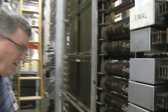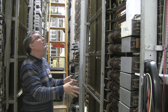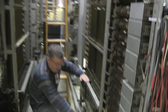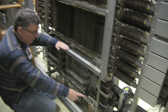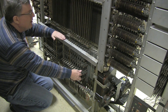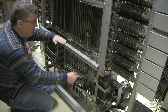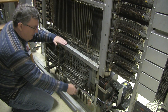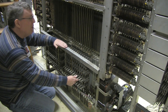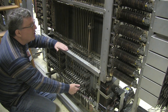The other thing that the motor does is drive the panels, which is the thing that gives the panel switch its name. Down at the bottom there's another shaft that runs this way, and there are a pair of solenoid-driven clutches — a fast clutch, which is the upper one, that drives the rod quickly, and then a slow clutch that drives it more slowly.